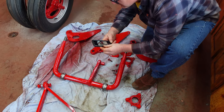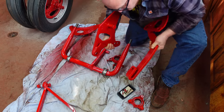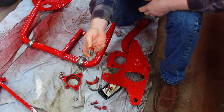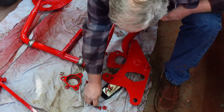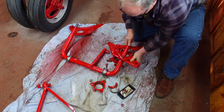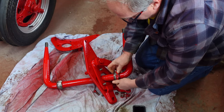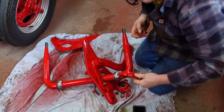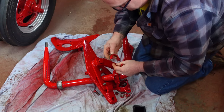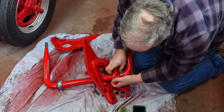So we're going to put these two pieces together. I know that one goes that way and this one goes this way — and they do that kind of deal. This side gets plow bolts because they sit flush in here in the recesses. And then this whole thing slides on to the yoke here. And then for this joint here we've got a two-piece to hold it in. And then we've got this that holds the pieces all in, so that goes over here, captures like that. Then these sides go on like this, and now it's captured in that knuckle.